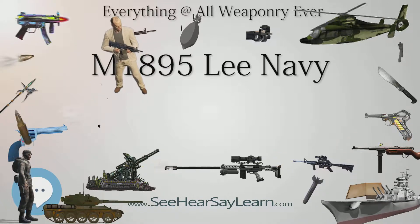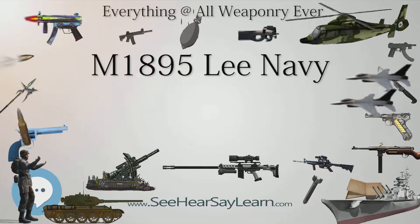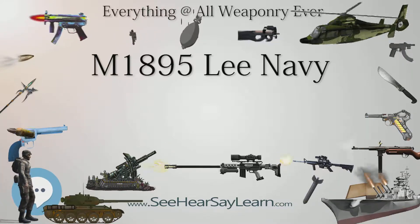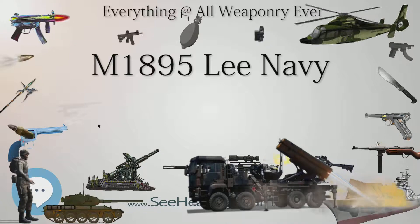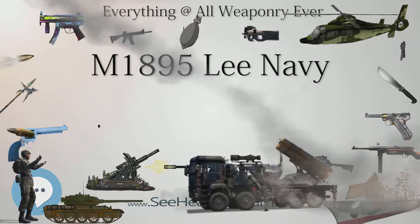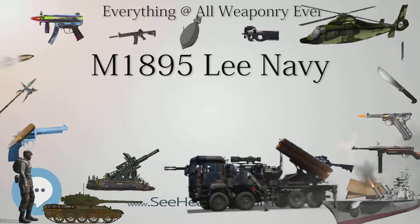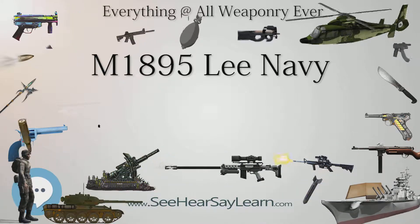On August 1, 1894, a naval test board was convened at the Naval Torpedo Station in Newport, Rhode Island, to test submitted magazine rifles in the new 6mm Navy government chambering. Per the terms of the notice to inventors, the new government-designed 6mm U.S.N. ball cartridge was the only cartridge permitted. Both the ammunition and rifle barrels were supplied by the government; the barrels, made of 4.5% nickel steel, used Metford pattern rifling with a rifling twist of one turn in 6.5 inches. The rifle action was required to withstand the firing of 5 overpressure proof cartridges with a chamber pressure of 60,000 psi.